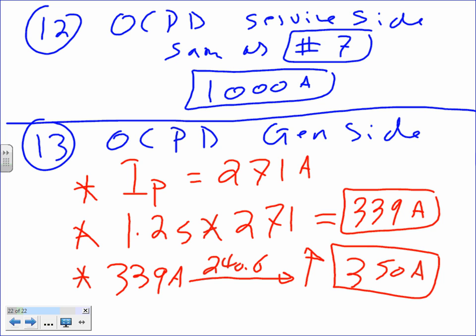And if anybody, guys, asks where the heck Chad came up with this number, this is coming from table 450.3(B). Like a transformer, a primary of a transformer. And if you read this, it has a note number 1. It tells you if you hit a non-standard size, there are 3 ways. Either you custom design yourself one, you go to the bar, drink and cry, or you go up. That's what note number 1 will tell you. So for most of us, we'll go up.